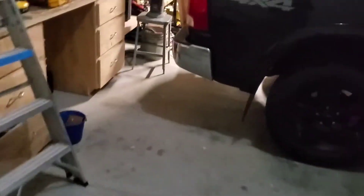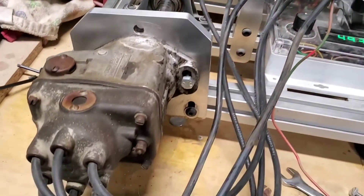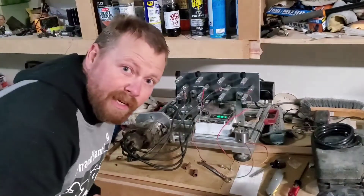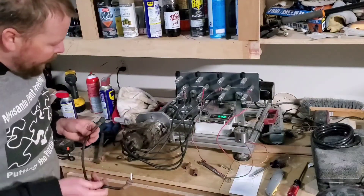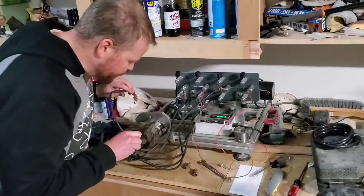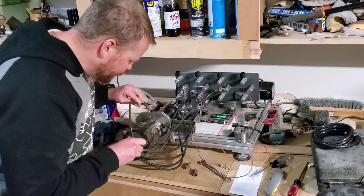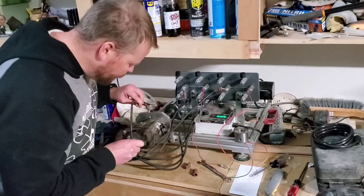But I'm going to call that fixed. I'm going to put the light back on. That's sweet — I'm excited. Good old American Bosch Magneto. Now I'm going to check if the shutoff works — the magnetic shutoff. It's right here; I'm just going to ground that out and see if it kills all the spark. I haven't tried this yet. That does not work.